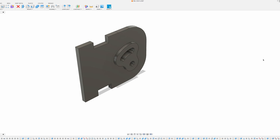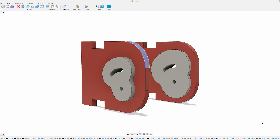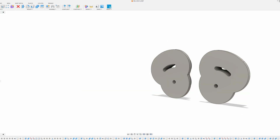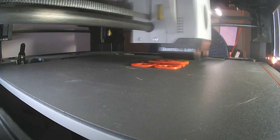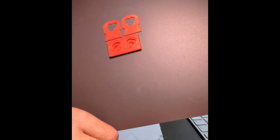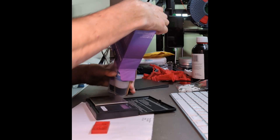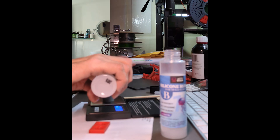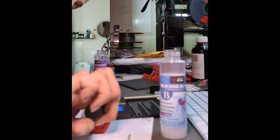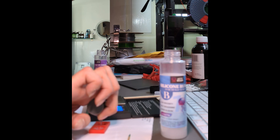Here's some more CAD starting from the mounts I showed you earlier, and some sped-up clips of me working on it. What I've been aiming for is two silicone inserts that sit inside the plastic mounts. To make silicone mounts we need a mold, so that's what I'm making in this sped-up clip. The finished 3D prints are two mounts and the mold. This is the silicone kit — 10 pounds from Amazon — you mix equal amounts from the two bottles: I mixed two grams, one gram of each solution, give it a really good stir, then start pouring it into the mold. I left it overnight and in the morning they were ready.